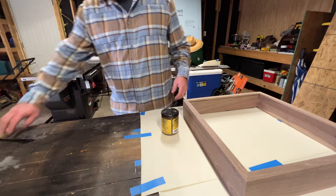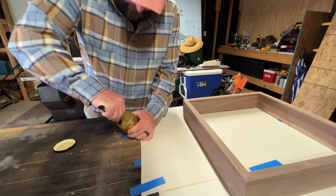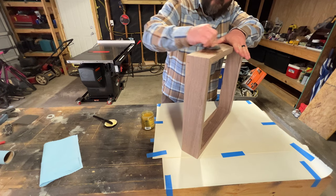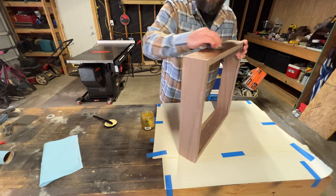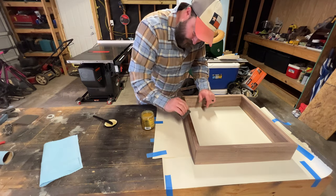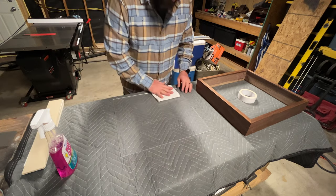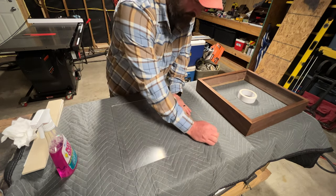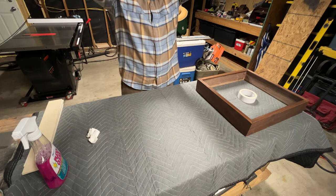You're going to see Odie's oil here, and I know there's lots of controversy surrounding it. But I spent $45 on this jar over a year ago, I'm going to use it — plus it's easy to apply and it's a picture frame, so it should be fine. I took a gray Scotch-Brite pad and worked the oil into the frame all the way around — each side, the front, the back — until it was good. Once it dried for a while, I came back and buffed it out with a microfiber cloth. The inside of the frame isn't finished, which normally you'd want to do to prevent uneven moisture and cupping, but I needed the strips of plywood veneered with mat board to adhere to the inside, and I knew they wouldn't stick well to the Odie's oil, so I left it unfinished.